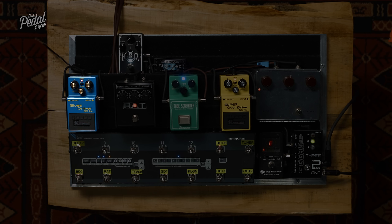And the Klon's really interesting because when you turn the gain, you're actually mixing. It's a mix knob, one part clean signal, part into the gain. So there are so many different ways to do that. But understanding that we have our input stage, our gain stage, clipping, shaping, the tone stage, and then the output stage. And again, you can take a tone stage out and just have clipping straight out, like a fuzz pedal does, for example. So the purpose of simplifying it like that is because that's predominantly what's going on, certainly on the overdrive pedals we just had on the board before this section.